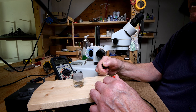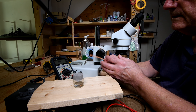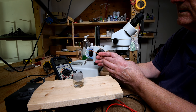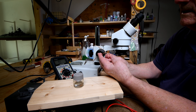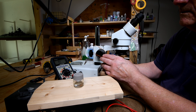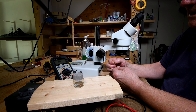What I think it might be is a lubricant, and here's why. If these strands have to flex - like a dry lubricant - when they bend, the inside wire is going to want to go out and the outside wire is going to pull back. So there could be a lubricant in there that helps them slide against each other really well, reducing the chance of breaking a strand.